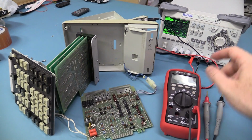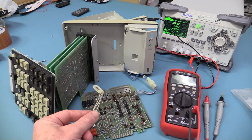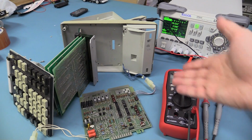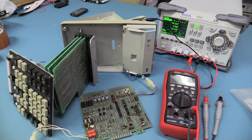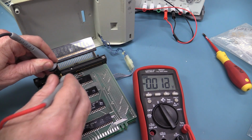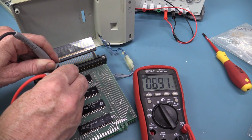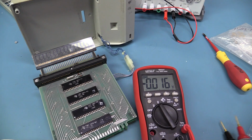And if I power up just the power supply board on its own with the display supply disconnected, we're getting 90 milliamps. That's pretty much what you'd expect ballpark for the quiescent supply of something like this old school power supply. So no problems at all. We're basically looking for gross excess current faults here. And let's check the power rail here and across this main filter cap up here, and bingo, 4.9 volts. Presumably it's 5 volt logic, and I'm happy with 4.9. That's certainly well within spec.